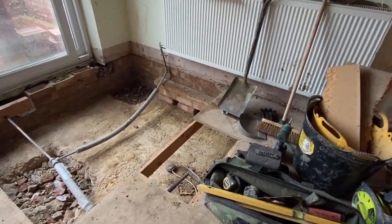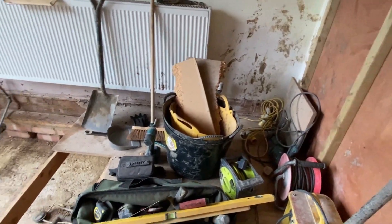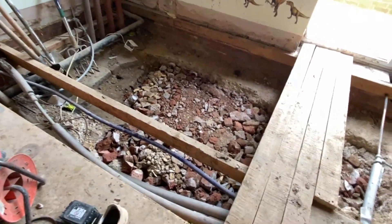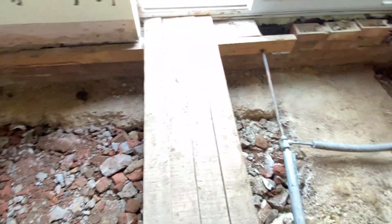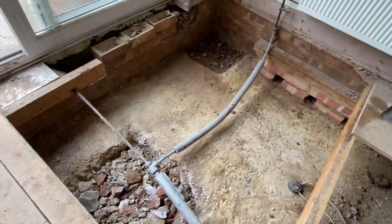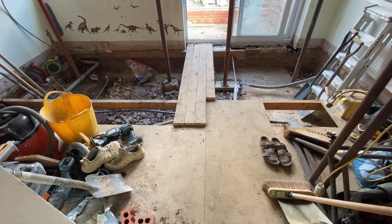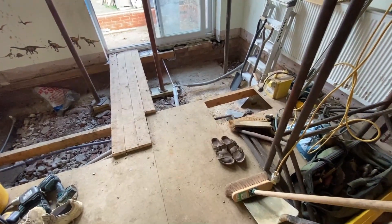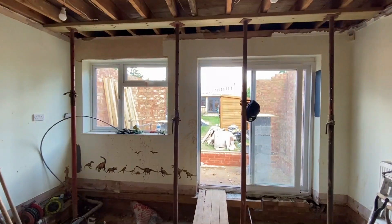Once the pea shingle reached the right level, we then backfilled the hole with the material we dug out. In this room previously there was a huge mountain of mud — everything taken out of the hole — and we kept that deliberately because we want to put it back in as loose fill. This will be underneath the floorboards eventually. We're putting in some underfloor heating, but it will be below floor level so we can leave this as loose fill rather than solid concrete. Hopefully you've enjoyed what you've seen — please give us a thumbs up, subscribe if you haven't already, and we'll see you in the next video.